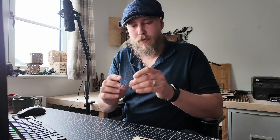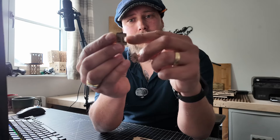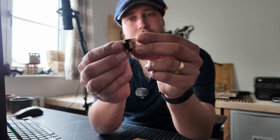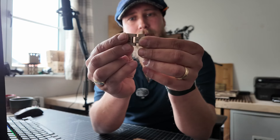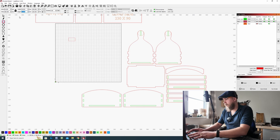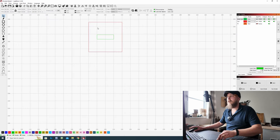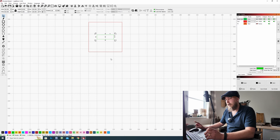There's one last thing we need to do before we wrap this video up — we need to make one of these tabs. It's going to be similar to this but it's actually going to be a hole rather than a notch, like a traditional finger joint, so we can see what offset we need to plug into Lightburn to get the best fit possible. Draw a rectangle, make it about 40 by 40mm — a square. Within that, draw another rectangle for the slot: thickness of your material for the width so mine will be 6mm, and make the width of that 20mm. Make the inside layer green and the outside layer red.